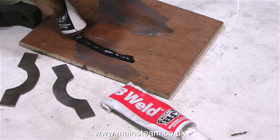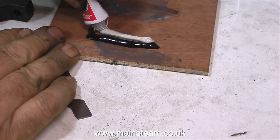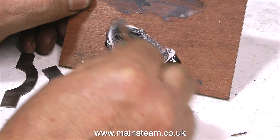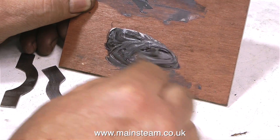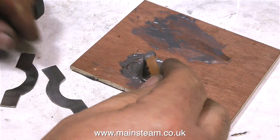You've just been watching me roughening up the part to make a good key for the resin. Now it's time to mix the two parts together. There's a little bit of urgency when you mix 5-minute epoxy, but this is the 24-hour version, so there's really no rush.